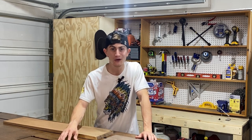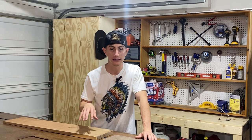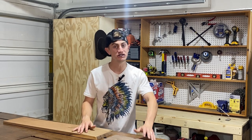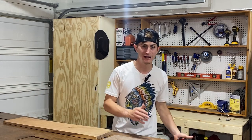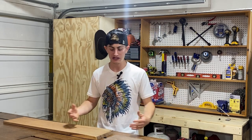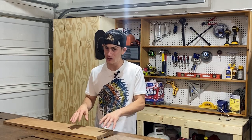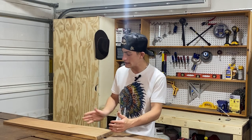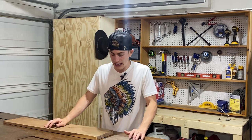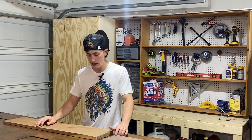That was a huge intro — a very quick down-and-dirty on how you calculate board feet, how you buy wood from a sawmill versus a big box store like Home Depot, Menards, or Lowe's, and why you might want to do that. Let's circle back to the startup cost I mentioned: your average amateur or hobbyist can't just go buy rough sawn lumber and expect to use it directly. Even though it's kiln dried, it may be warped or bowed. I paid a little extra per board foot to get a straight edge on each piece.